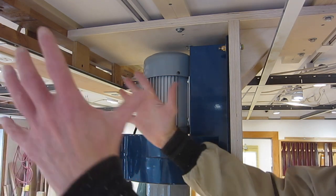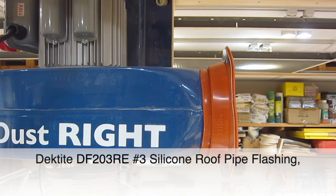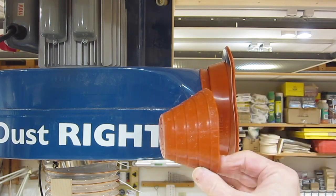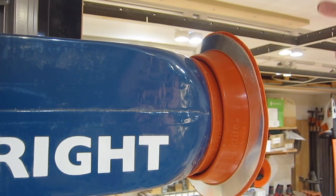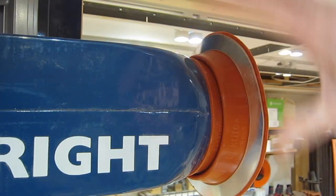I've got to build a box here to receive this port and support the filter. I'm using a deck-tight silicone flange boot — the kind used when a vent pipe goes through a metal roof — size number three, which fits up to a five-inch pipe maximum. You cut off the part you don't need at the five-inch point, and it has a nice flange that I can screw onto a plywood box. This will support the filter and provide some flexibility from vibration, so the vibration of the blower doesn't transfer into the plywood and create more noise.